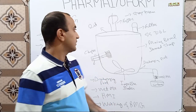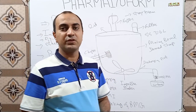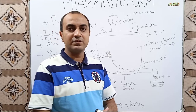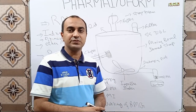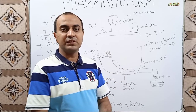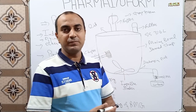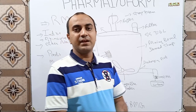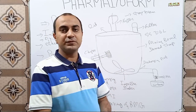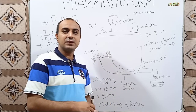What is RMG? RMG is basically a commonly used equipment in pharmaceutical industries, which is used for the mixing and kneading process during the granulation stages of tablet manufacturing. RMG stands for Rapid Mixing Granulator. It is used for the mixing of dry powders in the pre-mixing stage and for the wetting and kneading purpose during tablet manufacturing in pharmaceutical industries.